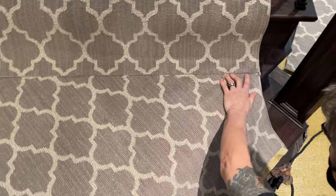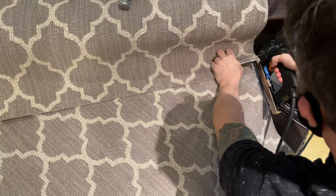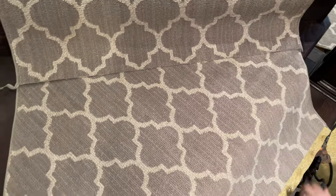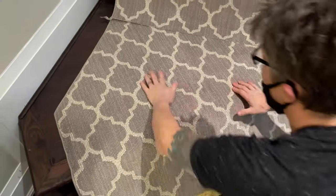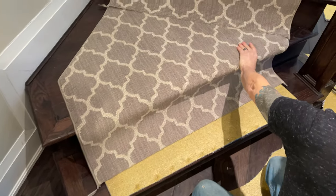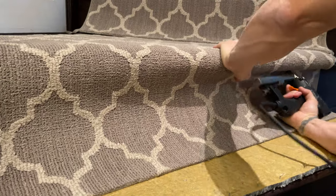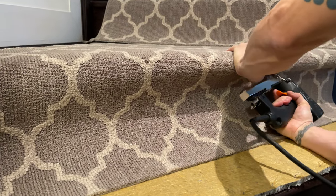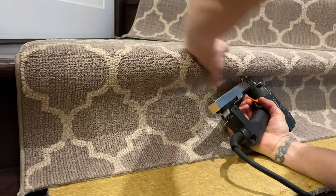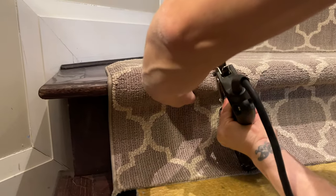This carpet is really, really difficult to work with — not because it's bad carpet, it's an extremely tough, hard textile. It's comfortable on the feet but it will never wear out — this stuff is amazing. We've been putting in a ton of it. You can check out some of the other videos — we do herringbone and a couple other patterns. Here I am folding over the nose, putting pressure underneath, and popping one to two staples in to hold it in place, usually a staple every inch.